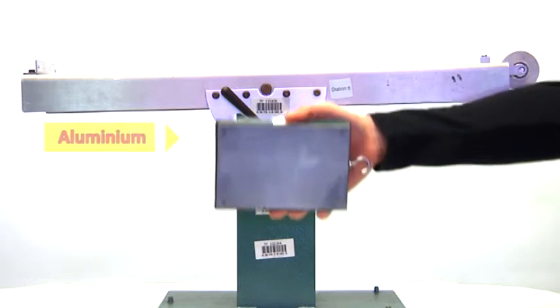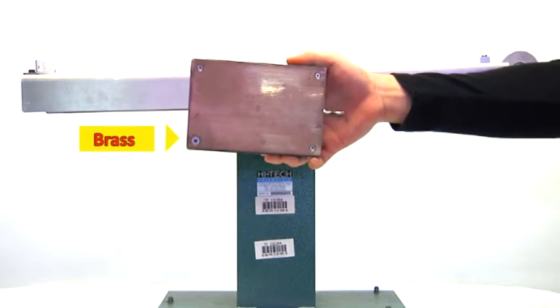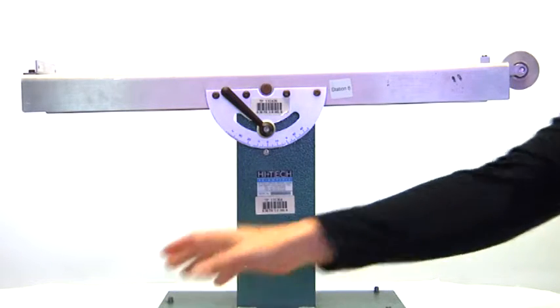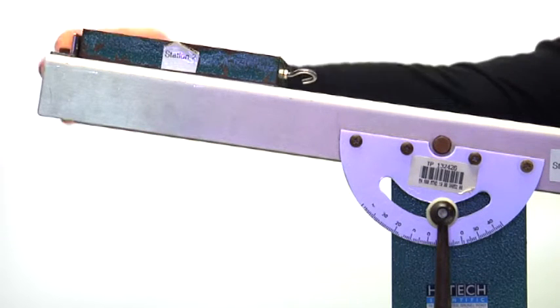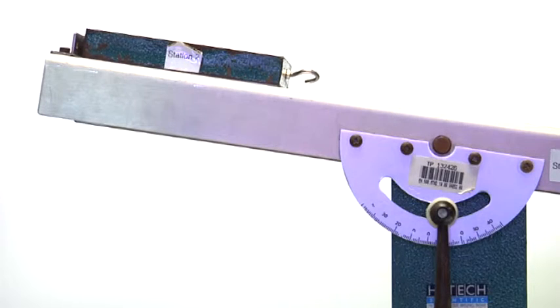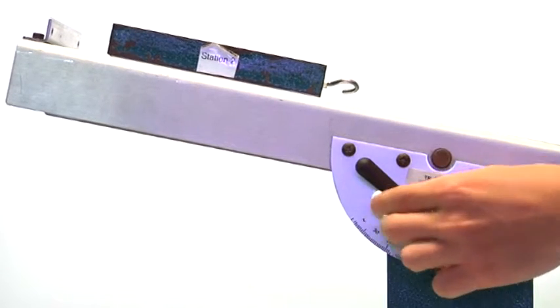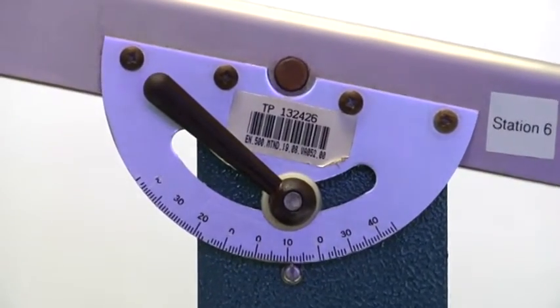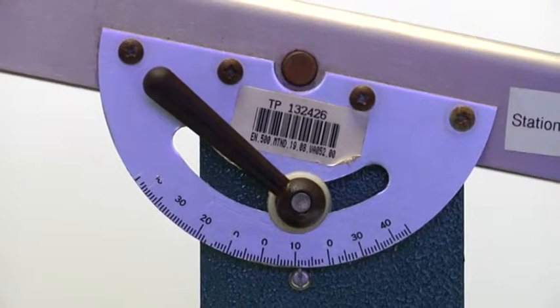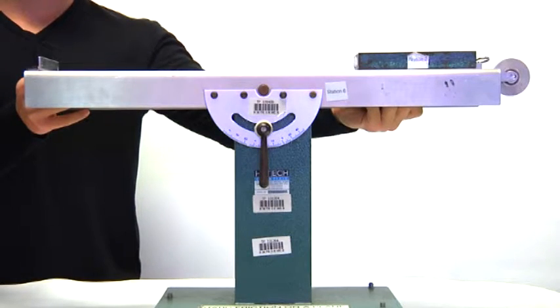Test aluminium and brass. It may be necessary to give the tray a slight push to start it moving, in which case there will be two angles of tilt. Tighten the plane with the clamp and get assistance from your team members to read the angle. Record the reading in degrees in table 2 in the lab sheet. Repeat the similar experiment three times and record in table 2.